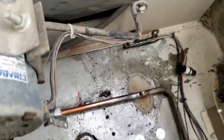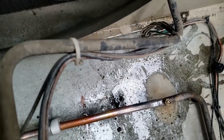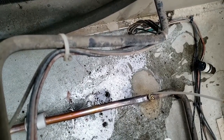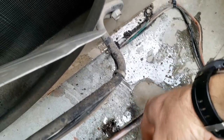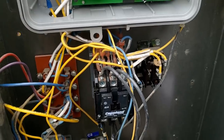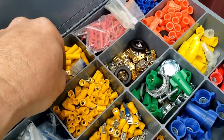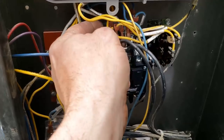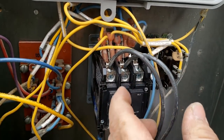Got the pipe in there with a little clamp I built using double-sided foam tape. We've got a Schrader core in the port now, so if we ever have to change the switch we'll be able to. I've got a Zoom Spout oiler changed over to POE oil, which I'm using on the threads. Got the new contactor in there — had to use some extra jumpers, kind of call them piggybacks. Most of those wires are control wires and they're crimped down good.